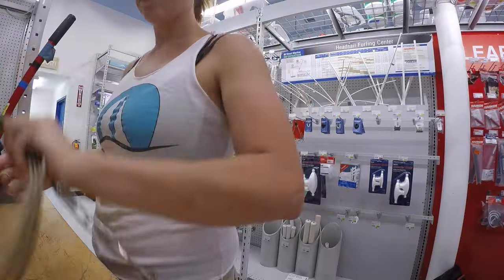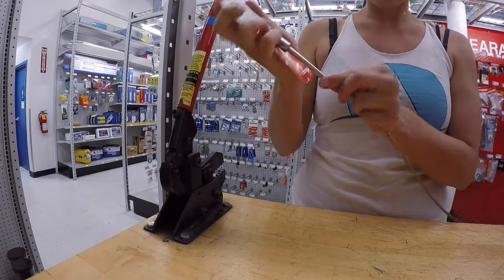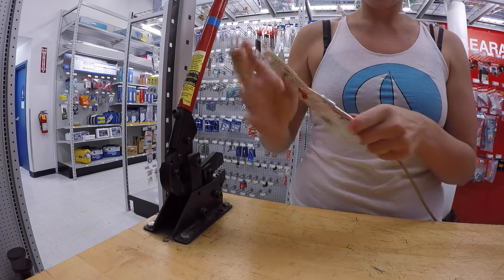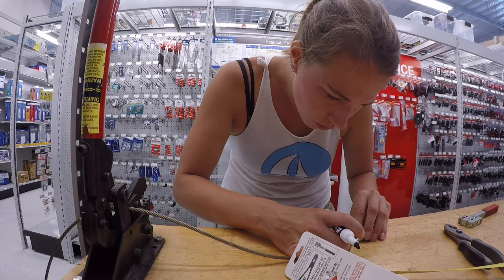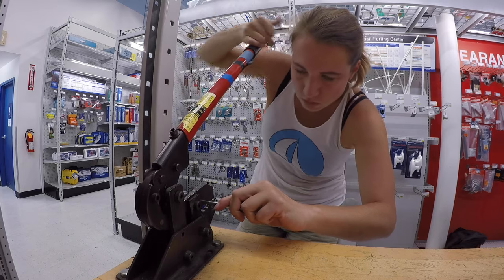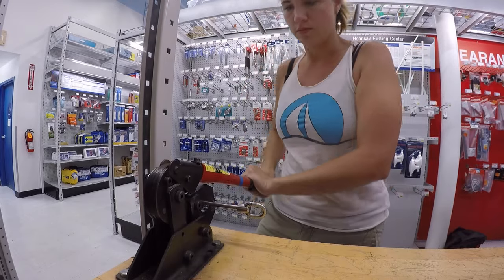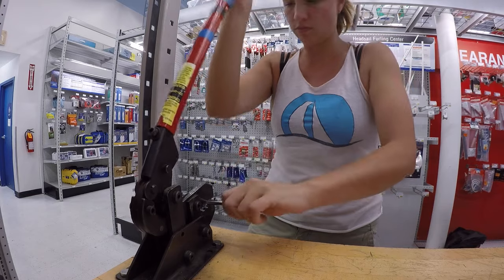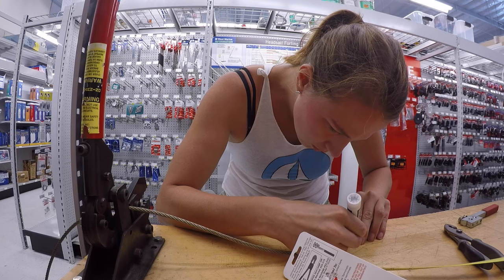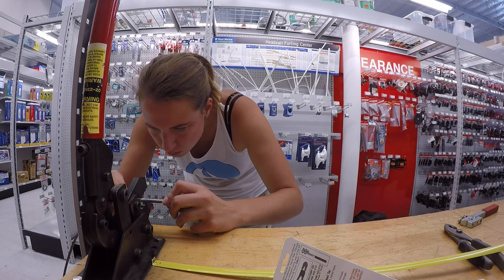While Varuna was getting pushed and pulled around to swing her nose in towards the dock for the guys to work on the bowsprit, apparently a few too many hands had pulled on the lower starboard lifeline, breaking it free of the fitting. I headed over to West Marine to get a new fitting and re-crimp it onto the wire.